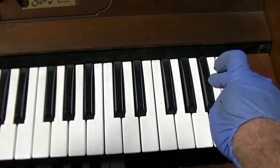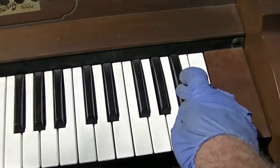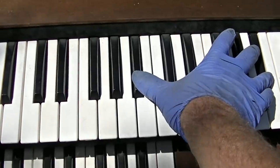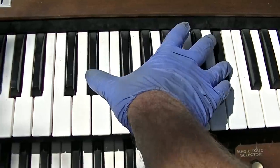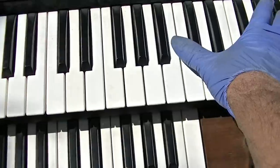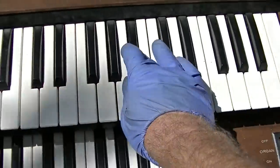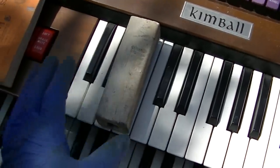So this is the first, and then each one down is one of the divider ICs. You can hear that's the same pitch. So the divider IC is not working, like this. And there's just more noise as you go down. Listen. So what I'm going to do is I'm going to put that on there.